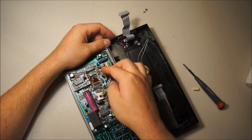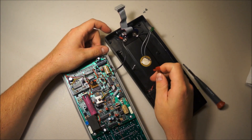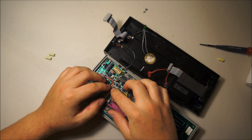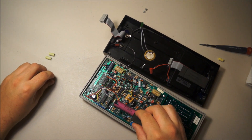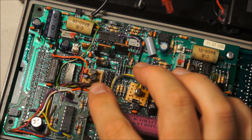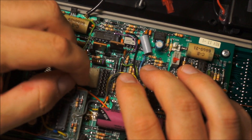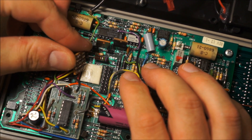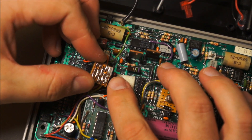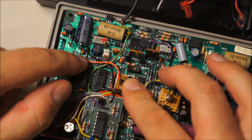But have a look at that — there are pieces of strip board in here. So this is presumably production equipment, and they have little tiny hand-wired, point-to-point wired strip board assemblies in here. So somebody must have at the factory been doing these little hand-soldered strip board assemblies, and then point-to-point wiring them into the logic to make it work.